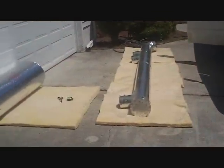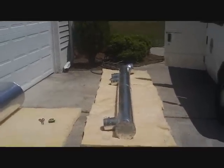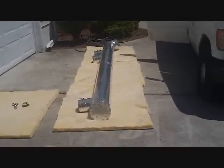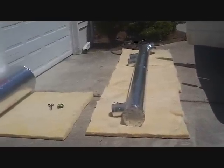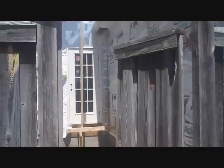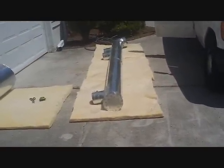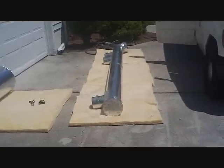I got my trunk duct made for the lower addition area. That elbow there is going to be another three foot piece coming off that elbow going this direction, and that's going to pass through that masonry wall that I busted through. This is where we're going to run alongside the old wall of the house — you can see there's the addition right there. It's going to feed the lower addition with three run-outs: two for the dining area and one for the restroom. I'm going to go ahead and insulate that and put it in place.